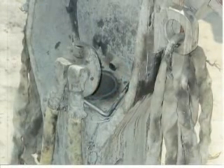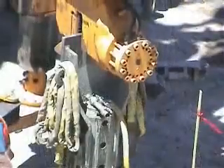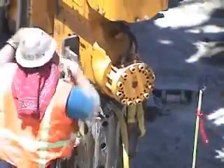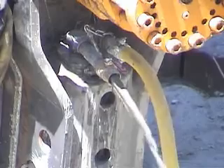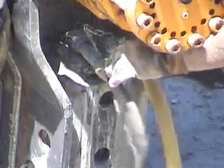The head of the probe could be locked and sealed, and was provided with an entry port for grout and an exit port for the air it displaces. A ball valve was positioned at the exit port to seal the lid and pressurize the grout at the tip of the pile and to fill the void while extracting the probe.